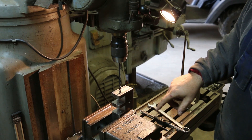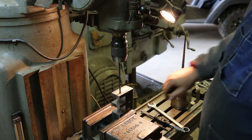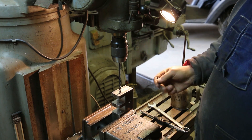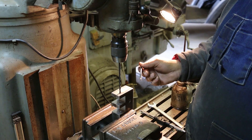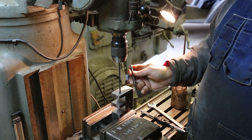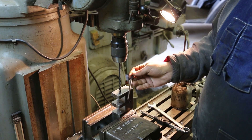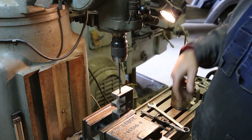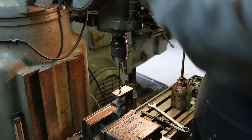The last thing to do is to drill and tap this quarter-20 hole in the bottom. Some of you might ask why I went with a quarter inch. Ideally I would have liked a slightly bigger pin, but I had a long-reach quarter-20 tap on hand — that's really the reason. These are called pulley taps because they were often used to tap set screws on a pulley, so you needed a long tap to reach down through the rim. I had a couple in quarter-20 size. For quarter-20, of course, you need to drill with a number seven drill bit.